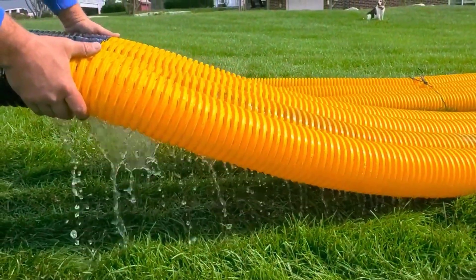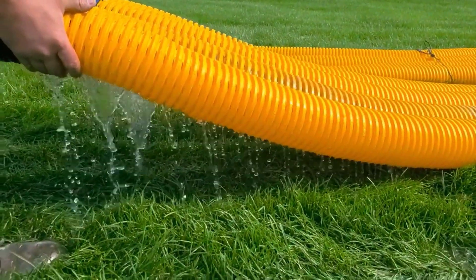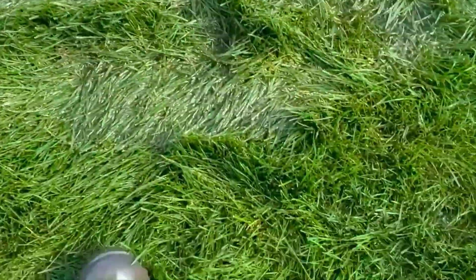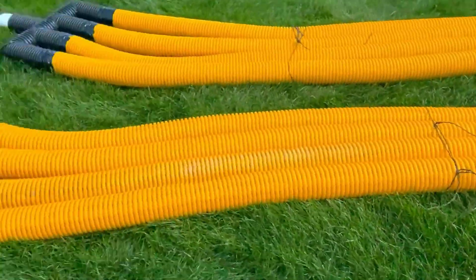The eight slot just pours out — just like a sieve. All the water just pours out; it doesn't get a chance to travel the length of the leach field. That's why you build the leach field — so that you disperse the water over a large area.